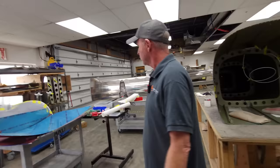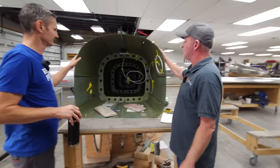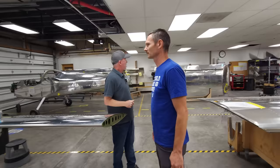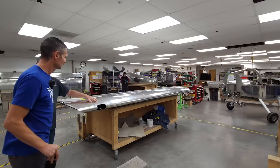These shapes are actually used for paint masking — they go on when we send it to paint. Here's a tail cone that's just come in. The first box is the tail kit, which includes the tail cone and the empennage — the stabilator, the vertical stabilizer, the rudder. We mass produce certain parts all at once, put them on the shelf, and then bring all these parts together as they go down the road. This particular airplane is almost all pulled rivets, with some solid rivets.